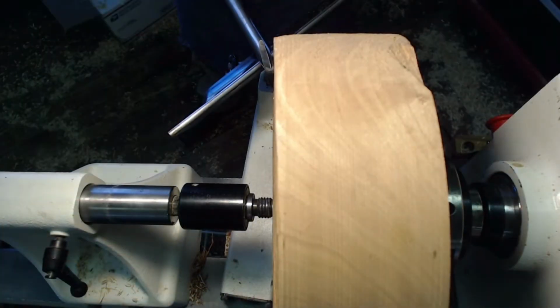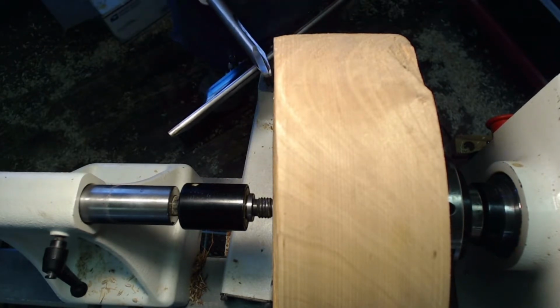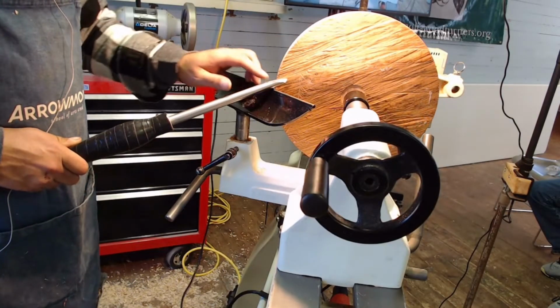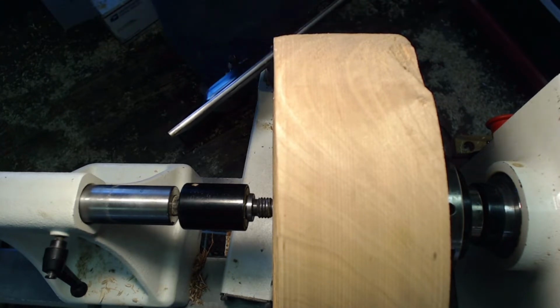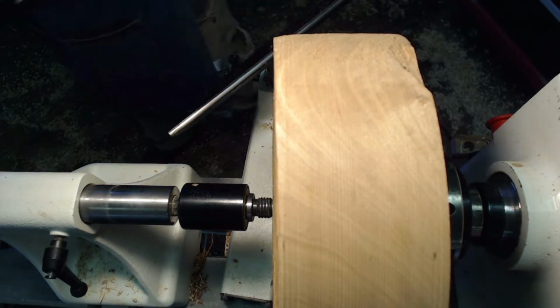And if I'm roughing stock out with something that's too inward ground like that, I might make a cut, and I might make some dust and shavings and chips. I won't make a really beautiful shaving because that unsupported edge is very close. I'm also likely going to hit that edge, and you're going to have some bad tear out. Whenever you're turning a bowl, unless you're shear scraping, you never want the unsupported edge that close to that cut at all. It's not a good thing at all.